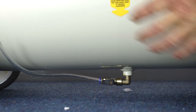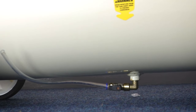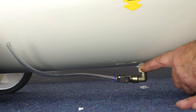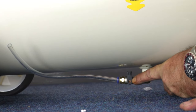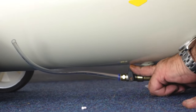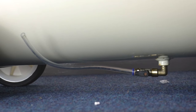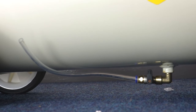When using a compressor, due to atmospheric conditions you get a buildup of water in the tank, and it's important to drain that regularly. We used to have a little screw nipple underneath the tank, but it's now a simple tap with a piece of pipe. In the vertical position the black tap shuts the air off. When you want to drain the water, place the pipe into a suitable container, turn the tap to horizontal and the tank will drain. I typically do that with low pressure in the tank — maybe one bar — at the end of a day. The residual air pressure will blow out the water. When you start getting air out, you know you've got all the water; switch the tap back off and you've drained your tank.